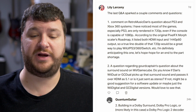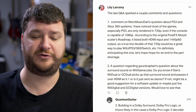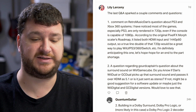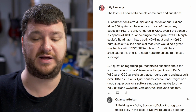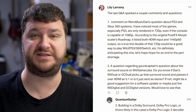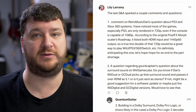Now over on Patreon, a couple of things from Lily Larceny. First, they wanted to comment about Retro Music Dan's question regarding PS3 and Xbox 360 systems, and since a lot of those games are only rendered in 720p and then scaled to 1080p from the console, any kind of scaler like the Pixel FX Morph or the OSSC Pro that could output 1440p should be able to line double that.